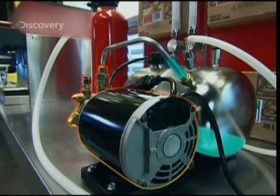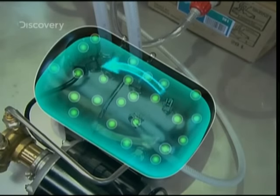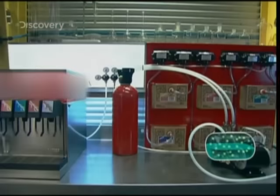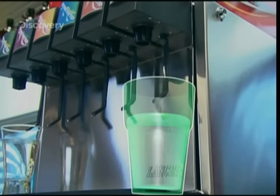When a tap is pushed in, the pump sends water to the carbonator. The cylinder also sends CO2 to the carbonator, whose job is to mix these seemingly incompatible substances to produce carbonated water. Once that miracle is achieved, the carbonated water is sent to the tap, and the syrup pump sends in the chosen flavour. The syrup and carbonated water mix together right before they pour from the tap. In barely 4.8 seconds, water and CO2 have been mixed, flavour added, and your cup filled.